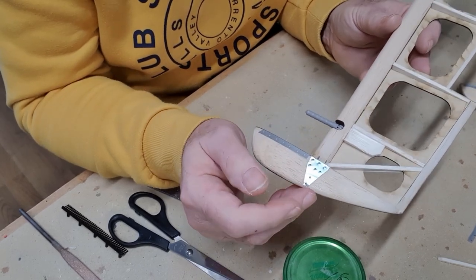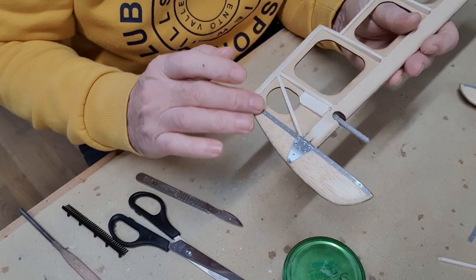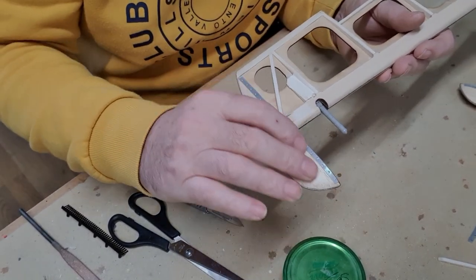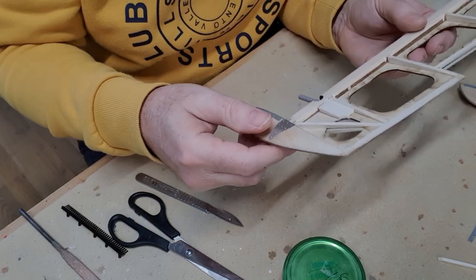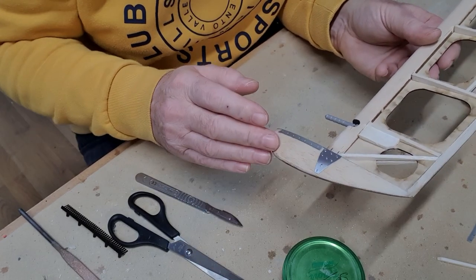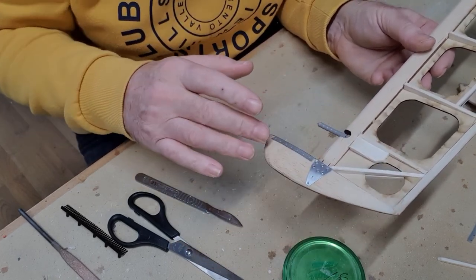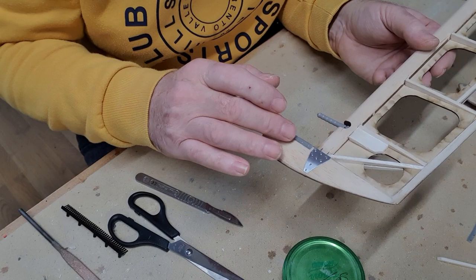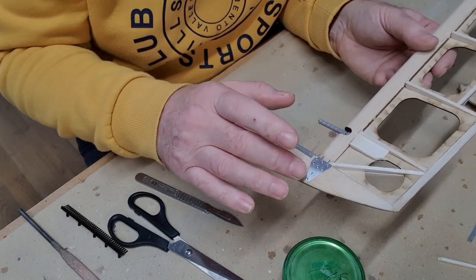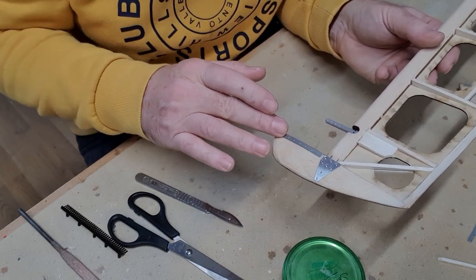What I've done underneath the elevator, there are some sections where the screw heads are that hold the fabric, that hold the wingtip or the elevator tip shroud to the frame, to this end rib. And it's lots of pop rivets. So what I've done is I've taken some litho plate and made the plate that you can see showing through the fabric, and some of these along here.